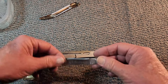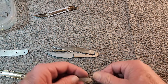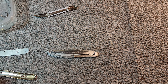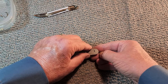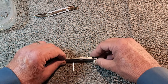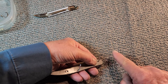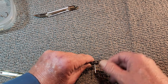Now we've got our main blade — it's going to go like that. We've got another spring here. This is just a two-bladed knife; just imagine when I go to put a Camp King back together what that's going to be like. These go to the outside again. So what I'm going to do is cut this down just a little more, then I'm going to peen on this end, poke it back through, cut the head off the nail there, and then start peening down.